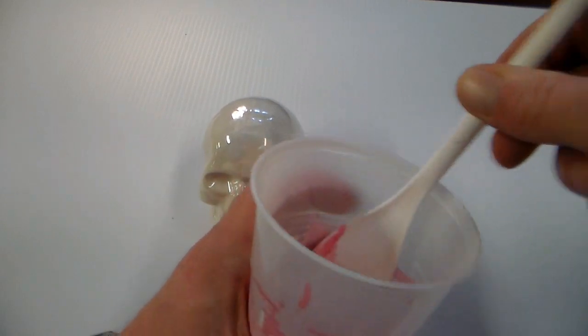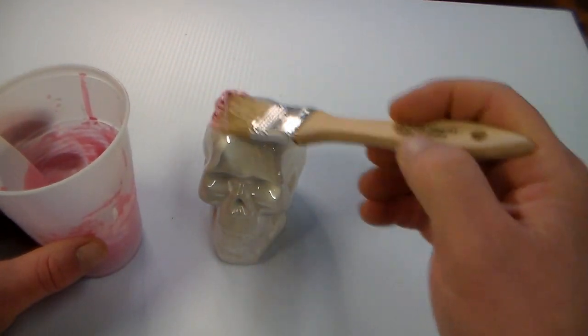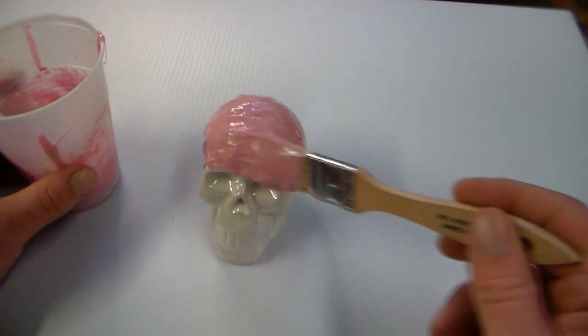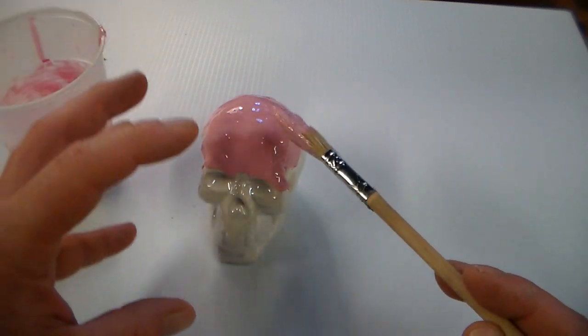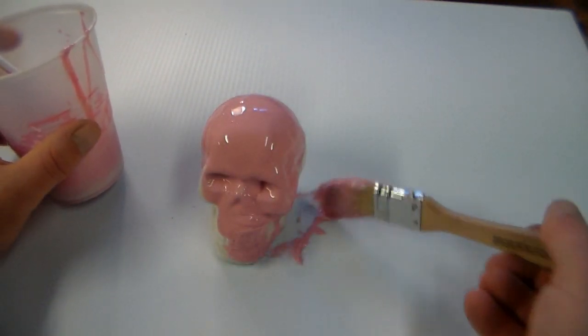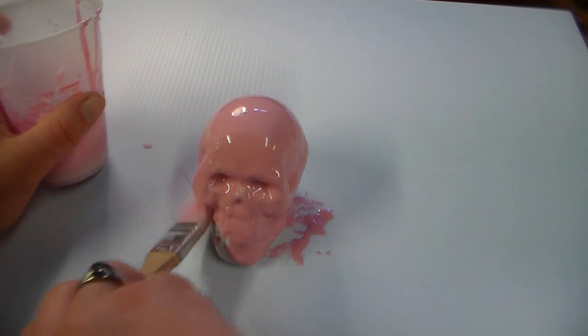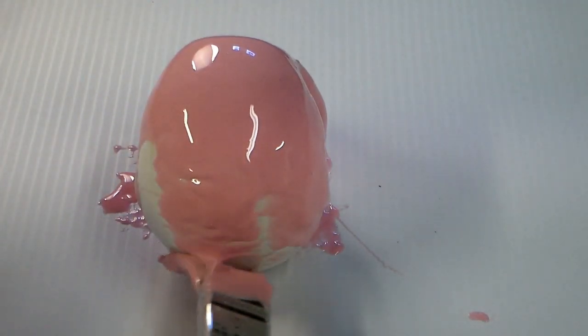Now that I've got this thoroughly stirred up, I'm just going to brush on a very even layer using a chip brush. This particular batch of silicone is actually quite old, so it has a tendency to thicken up — if you get brand new silicone it will probably have a thinner consistency and just by gravity have more of a tendency to drip and sag. We just want to make sure we get good even coverage with no air pockets. Your absolute biggest concern, other than even coverage, is no air bubbles — it'd be very easy to get some voids in these eyes or inside this nose.